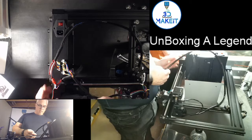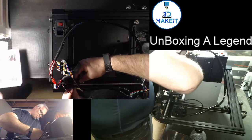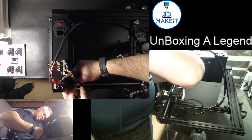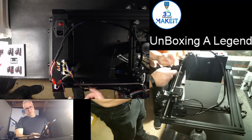In theory, you could flash that firmware, but you're going to run into problems because the pinout is different on those boards. So you're probably going to want to take the firmware and just edit the board, and then you could compile it and run it again. It'll work fine. So this one is a little unusual.